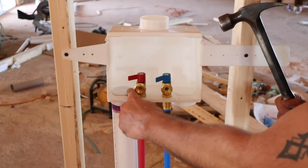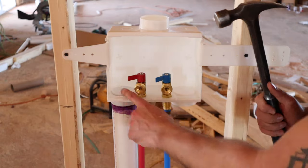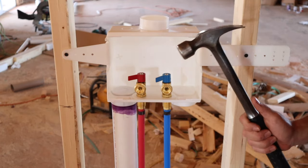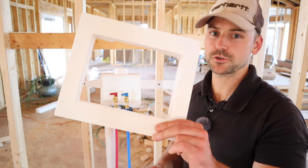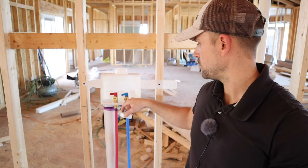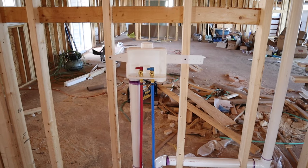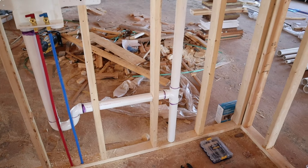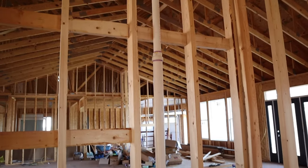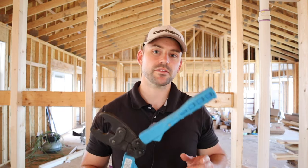A lot of people ask about the knockout and how it's sealed off where the drain line goes. You take a hammer and smash it in after your pressure test is done — they pre-score it for you so you don't have to worry about plugging it up later. The last two pieces in your kit are the trim piece that goes on after you install drywall to give the box a nice finished look, and a knockout plug in case you knock out the wrong side. Here is what the finished product looks like — the drain going to the trap and down to the main drain, and the vent pipe going up to connect to your main stack. If you're interested in any products used in this video, I'll put a link in the description for the clamping tool and the outlet box. I'm an affiliate of Home Depot so I may get a small percentage if you use the link.